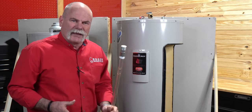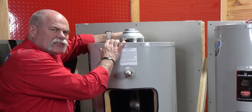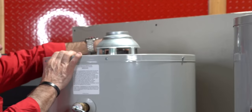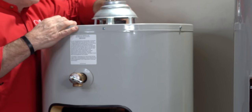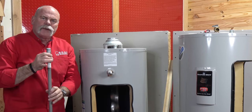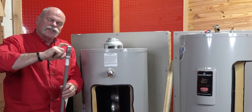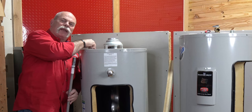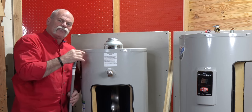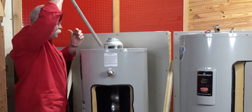All these things can be replaced. On a Bradford White water heater, the anode rod is on the hot water outlet side. If it's screaming, the noise is from water having problems there. A normal dielectric nipple without an anode rod is easy to change out too. If you have a water heater with a big hex nut up top somewhere, that's where your anode rod is.